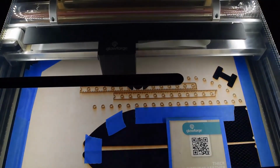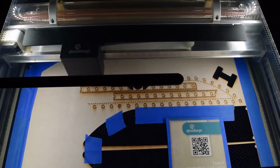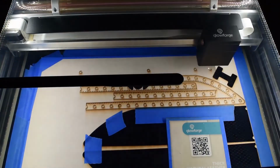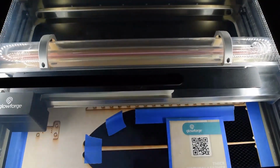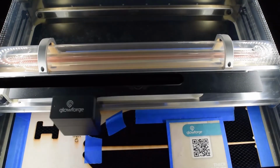Like I said in the last video, I've been programming industrial lasers and water jets for years. It's something that happens even with metal. A lot of heat generated will make the metal warp. So it's good to, after a little bit, especially with something pliable like leather, take a few of them out and make sure the material's not moving.